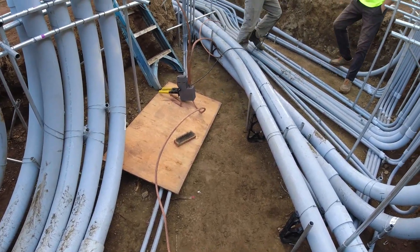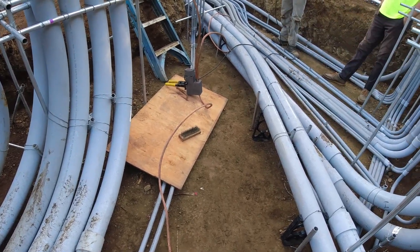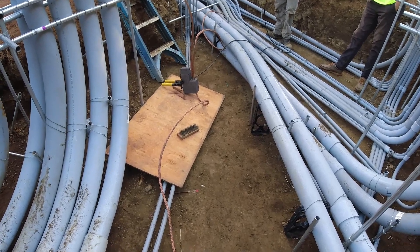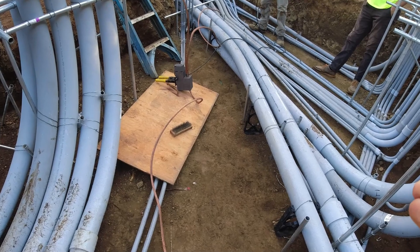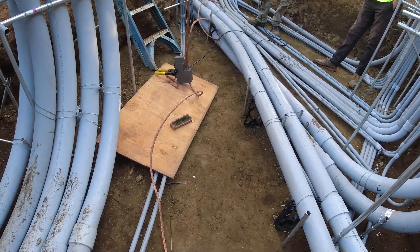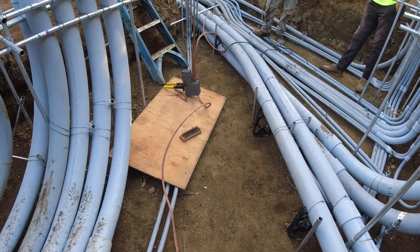After it fires, I like to get in there once it's safe and disconnect the cord so that the cord doesn't melt. Then I like to flip the lid and open the mold up and set the mold aside. Be real conscious though of where you put the mold and nobody else is going to touch it — it's not going to touch any pipes because that mold is now thousands of degrees after this.